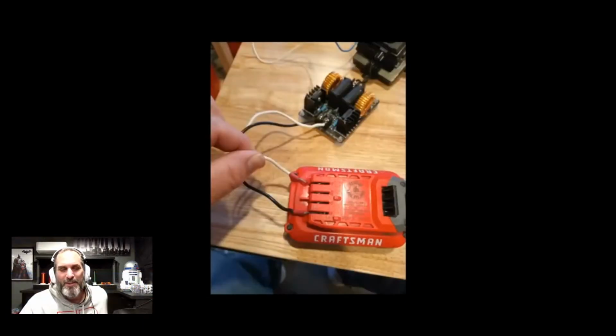Did I burn it up? Oh, you bet I did. First of all, I burnt the driver. I burnt the transistor that was in it, and I said, oh well, let's just go ahead and take it out. Then I took the DC flyback out and used it for other experiments, and it's dead now. These things aren't there to last forever, guys. Not the way I run them. As soon as you create a spark, it's pushing pressure back to the flyback, and it'll eventually kill it.